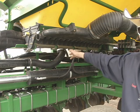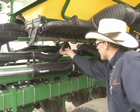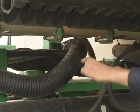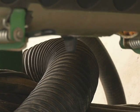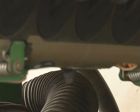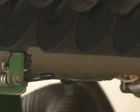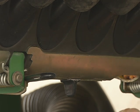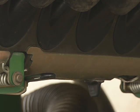If you want to take a sample out for whatever reason, you've got this little trap door which you can knock open, which only allows a little bit of product to flow out. So in that case, you'd want to empty one side with a bucket to even out and fill the other side if one CCS tank is too full and the other one's empty already when you're getting close to the end of an individual variety, or from one family farmer to the next. Then you can hold a bucket under this little tiny trap door and you can allow as much as you want to flow out, and then you can push this door shut. So that's the only way you can let some amount flow without emptying until gravity stops the flow.